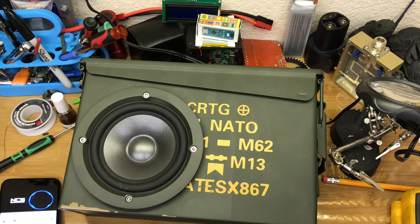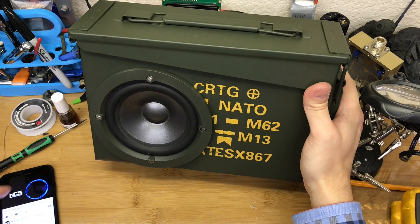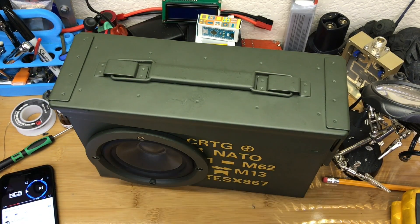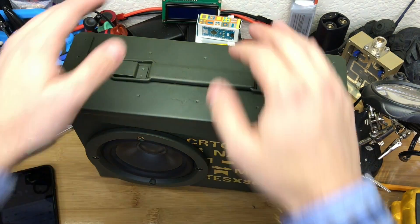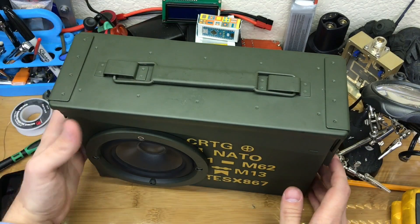It has the ability to get obnoxiously loud if you prefer — not bad. There's definitely a slight hiss, but I tested it earlier with just a switch-mode power supply and also direct from a larger battery pack to the Bluetooth module — I'll put the link in the description, I can't remember the model number right now — and I didn't notice a hiss then. So I think it's just something about boosting four volts up to 20 volts. Maybe I'll try four-to-eight and see if that gets rid of some of the hiss.